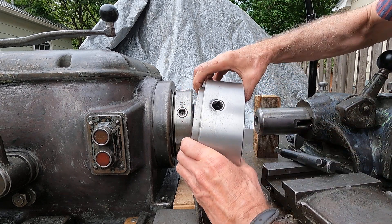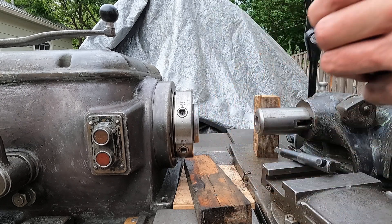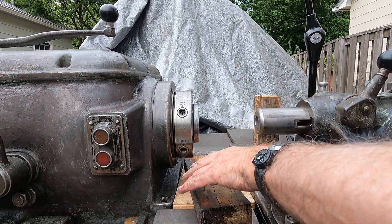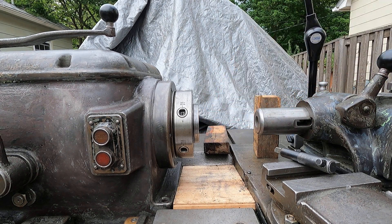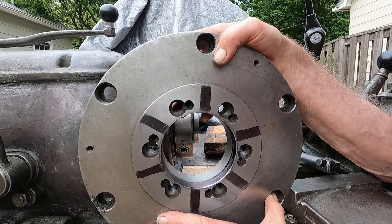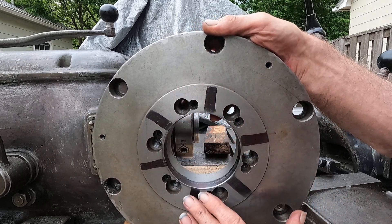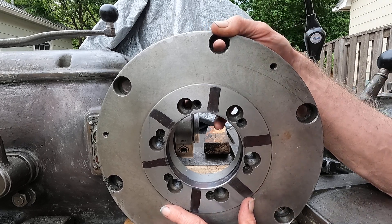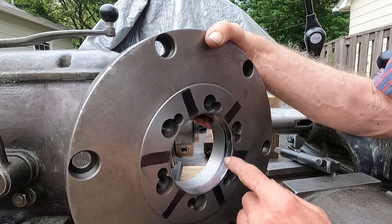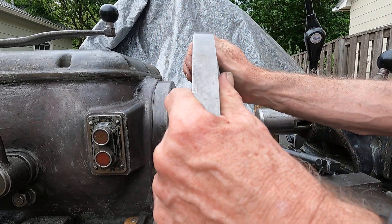Here's the face that I did. Now I've got to work the taper. Here is the back plate — not face plate, but back plate for the Bison chuck D16. I refaced this in the Brown & Sharpe milling machine. The taper seat is not bad — I put some ink on it, rotated and played around with it a little bit. It could be better, but it does what it's supposed to.